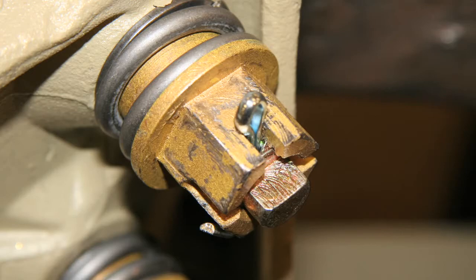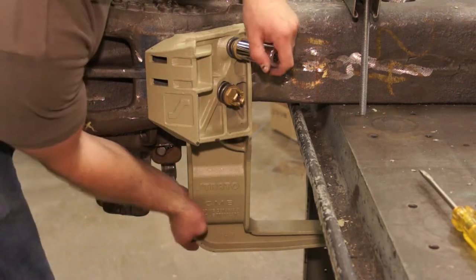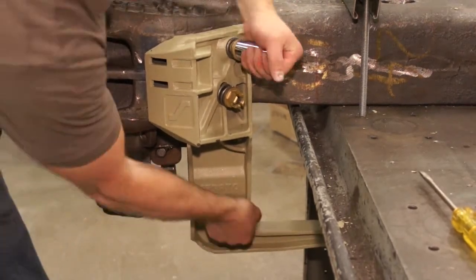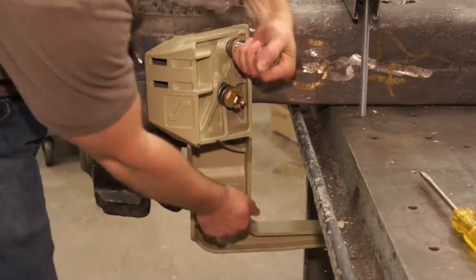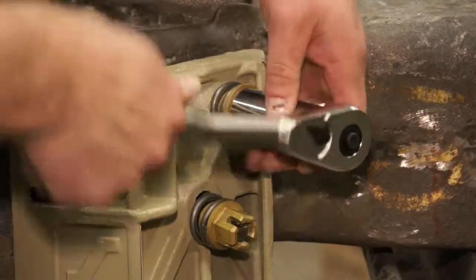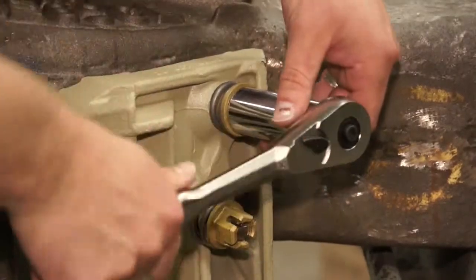in the up position. While rocking the CMB forward and back, hand tighten the top spring retainer assembly snug. Then tighten the bottom assembly snug. Now, using the ratchet wrench, tighten the top bolt until the Belleville washer is compressed flat by the retainer.